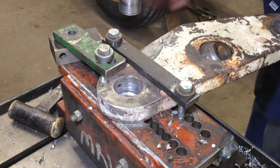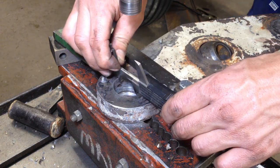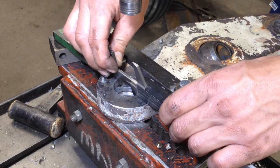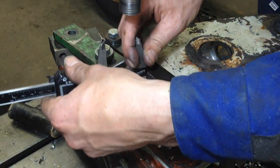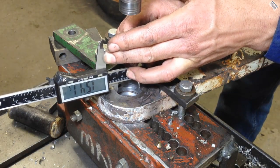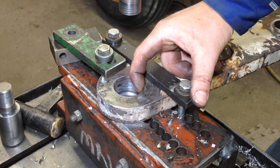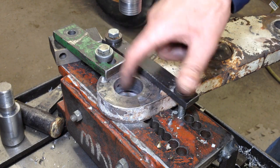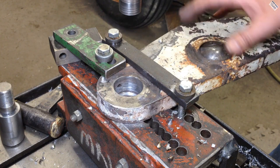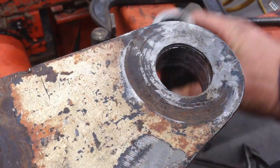Oh, how big is that? Yeah, 45 over still. Yeah, 40, 41 that direction. Just dawned on me, that's acceptable because I gotta make a bushing to fit in there, so I can make the bushing 40 thousandths over or 30 thousandths over. Duh, I don't have to be spot on because I make the bushing to fit. Yay, saved. I'm actually just gonna use a piece of DOM.